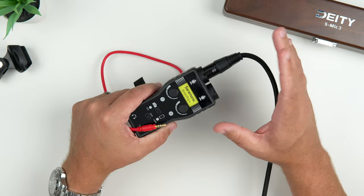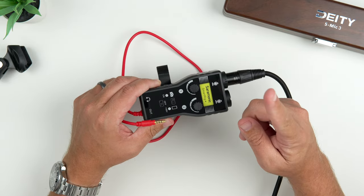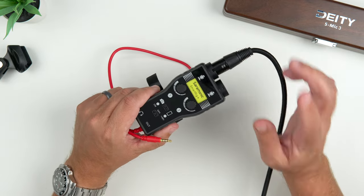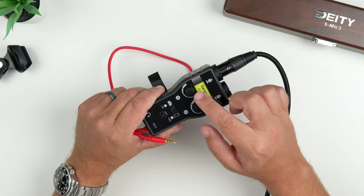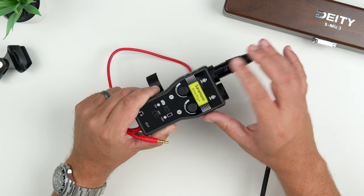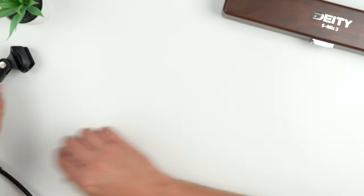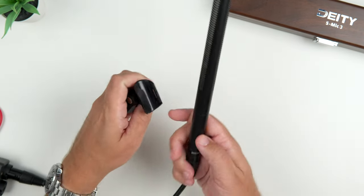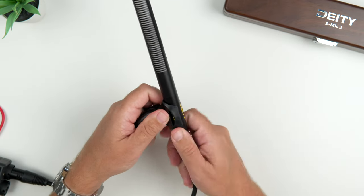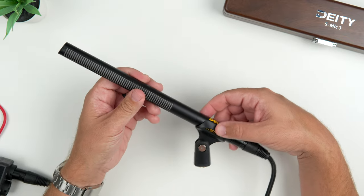And that's it — that's all you need. Nothing special, nothing fancy other than this. In the preamp, when I hook this up, I'm going to have my Sony a6700 recording level down to one, and I'm going to use the preamp dial for the gain to set it to hit negative 12. So let's go ahead and get this bad boy hooked up. I'll go ahead and mount this on here — very simple, you just click it in like that. Now let's get it on my boom arm and see what it sounds like.